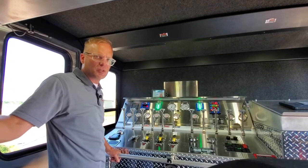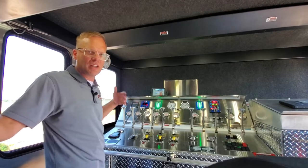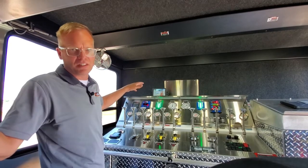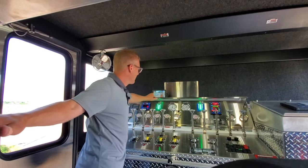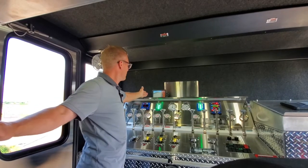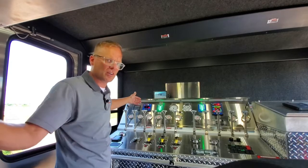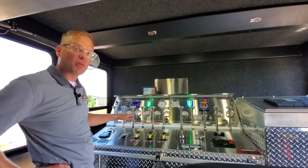We're at the operator panel inside the full response crew cab. You can tell right away that we do not have a back window — we've done a few trucks like this lately without a back window because camera technology has really improved, and what you can see on scene is just a lot more informative than in years past. In this case, we have a 360-style camera with side views, but also a front and a rear view. This is the rear view of the truck, which you would use to watch a rear folding tank or in a drafting situation, and the front view gives situational awareness for the pump operator.